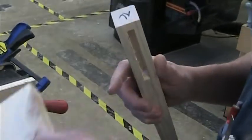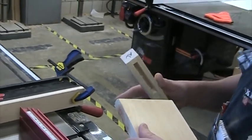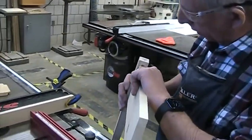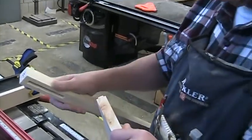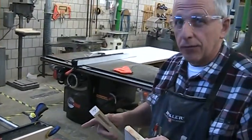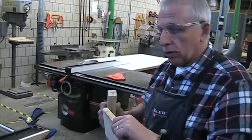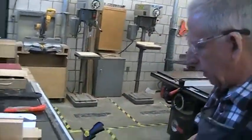You need one of your legs to do a test fit with. As you can see, the cut is a little too shallow, which makes the tenon too big — which is what I want at this stage. So I have a tenon that's too large, and I can just raise the blade a little bit to make it fit. Now realize I'm cutting both sides, so I'm going to raise the blade half of the error I notice. So if I think I'm off a thirty-second — because this is pretty close — I want to raise that blade about a sixty-fourth of an inch, because I'm going to cut a little bit off each side again. It's very easy to go too far, so be very patient with yourself as you do this.